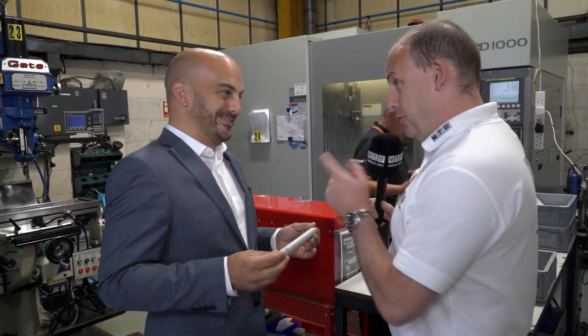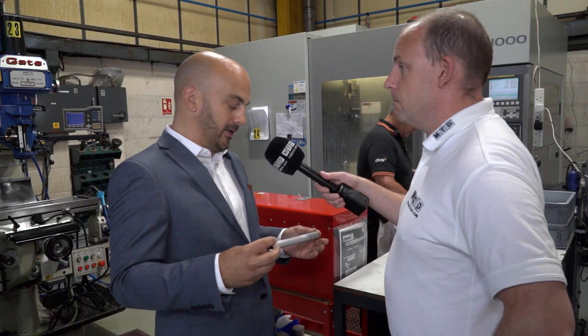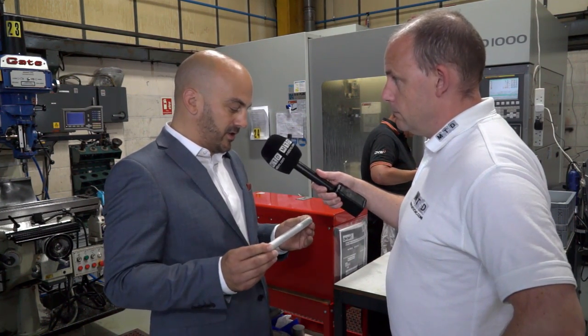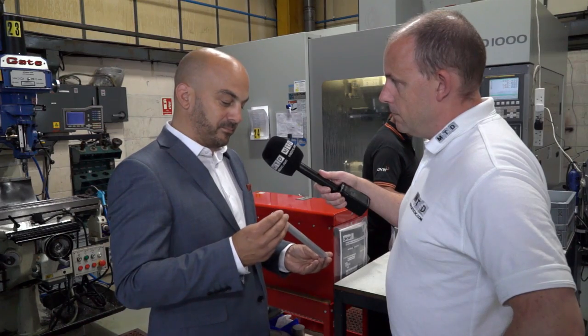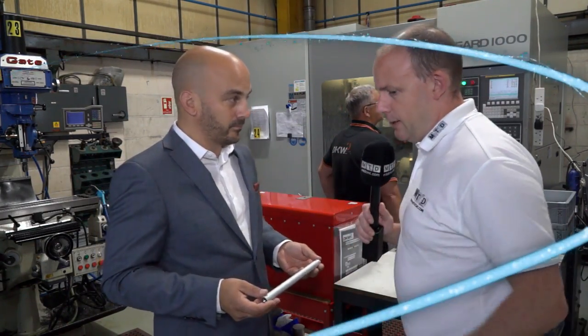To put myself on the spot — because you've got to remain competitive in today's market — I would say making something like that takes five minutes? If we were on the five-minute side of things, I'd be very disappointed. We're comfortably under three minutes. Start to finish? Yeah, button to button. The longest operation is loading it manually on the fourth axis. Because of the type of extrusion it is, we need to drive it off the internals, so you have some manual handling. Alright, so I was a bit out — let's go on to the next machine.